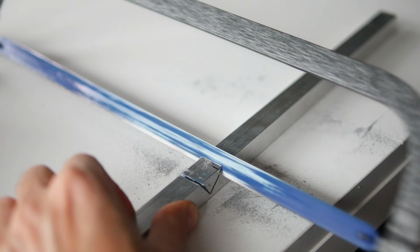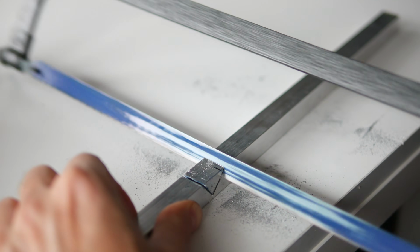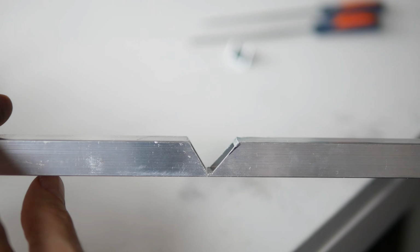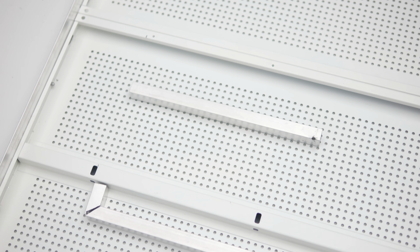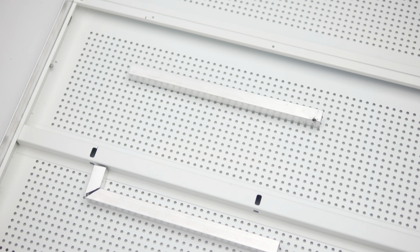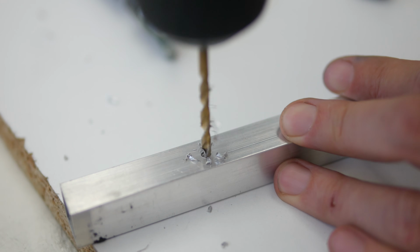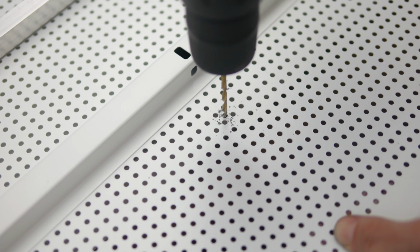Making a 90 degrees bend requires making 2 cuts at about 45 degrees angle each. After removing the excessive material and filing the edges, you gently bend the aluminum. You don't want to rush it, as you may easily break the profile. The middle section mounting holes are in a straight line, so making support for these was only a matter of cutting the aluminum to the length of the motherboard. The south motherboard's edge will rest on the shelf's outline. I marked position of both supports and attached each to the Algot shelf with the help from a good friend of mine, Mr. Riveter.